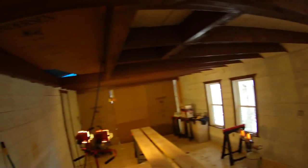So it's a nice strong brace, goes all the way to the beginning and end of the building, and then the load goes down. And underneath the house, don't assume that you have load, nice and secure underneath. You make sure you go underneath the house and verify that. So, okay, we have the opening here.